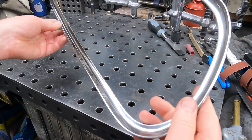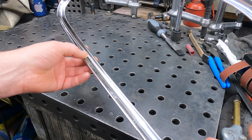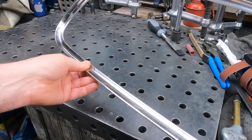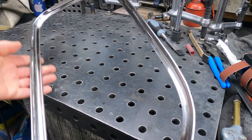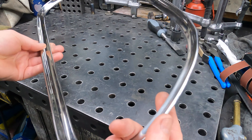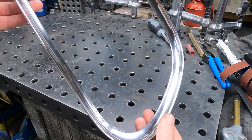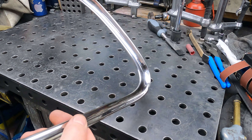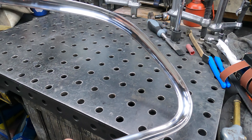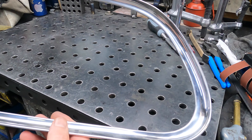This is how that surface is finished up — it's sanded to 1200 grit wet, just working your way through the grits. It takes a little bit of time. Making sure I've got all the edges done nicely and anywhere that's going to be seen looks good. All we're going to do now is buff it, which is going to take about five minutes, and then it'll be done.